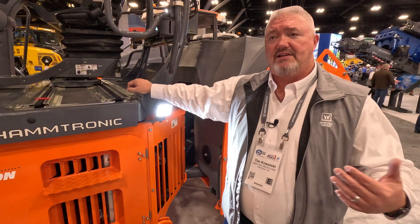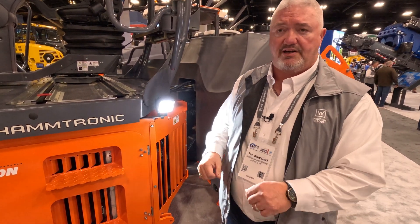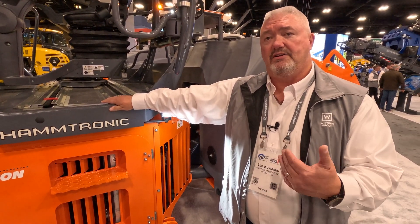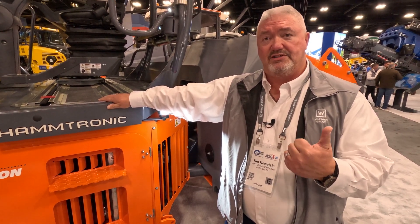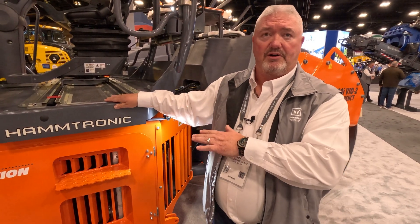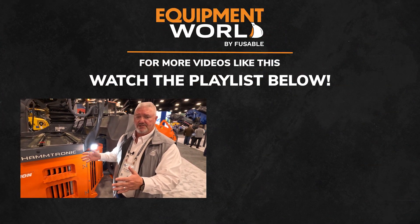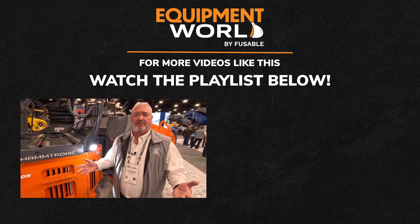There are a lot of states looking to possibly eliminate cores, and they've already tested this system with carts for final density — now we're putting it on a machine. If we can eliminate using cores and eliminate traffic control, it's a huge safety standpoint: we don't have people out on the road after the job is done. We can record final density from the machine, which is a huge savings to the contractor, delivers more consistent compacted material, and is a huge safety benefit for the public.